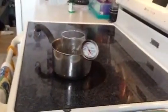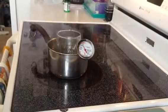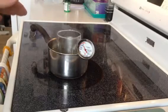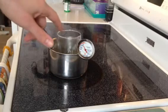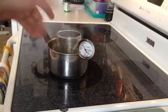In order to make the polymer gel electrolyte, it requires approximately 90 degrees centigrade of heating of the materials — that's about 194 degrees Fahrenheit — so I'm about ready.